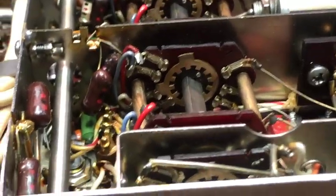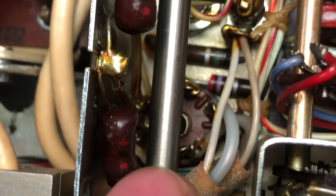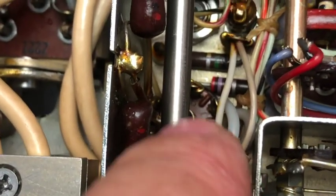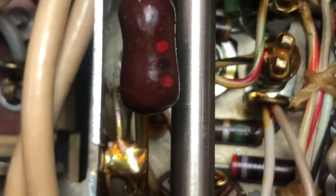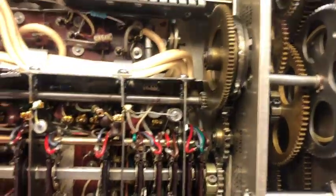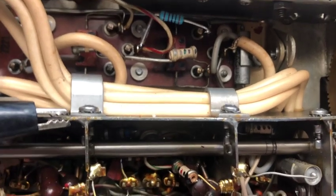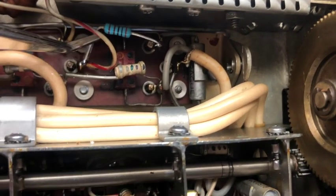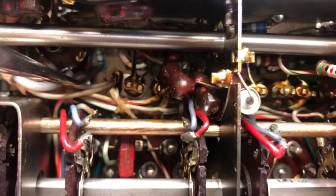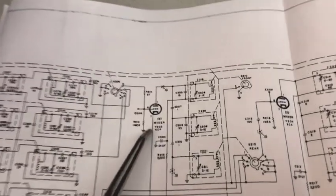By loosening this clamp I need to also check the components around these tubes, especially V203 which I believe has some problem. Well, I found the culprit for why I lost my signal. There were two resistors that were way out of tolerance — this one and that one back there — and they are both related to the first mixer.